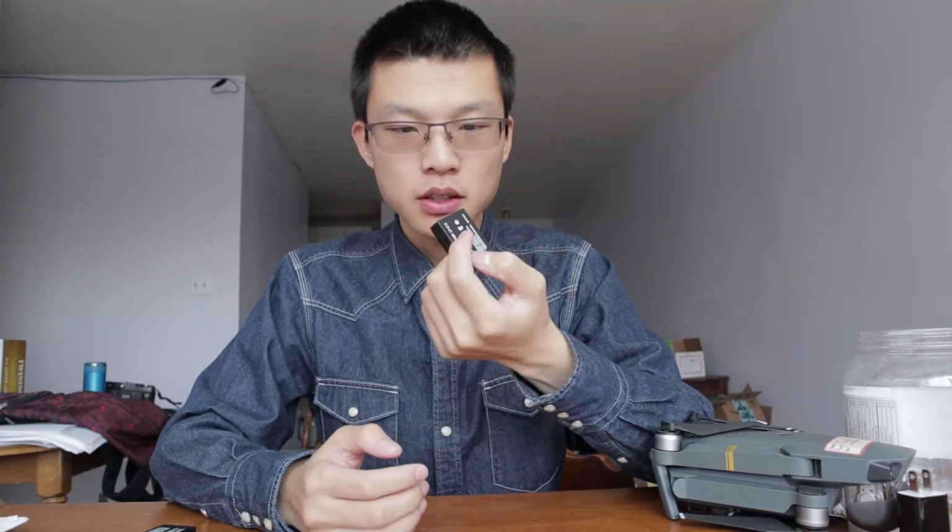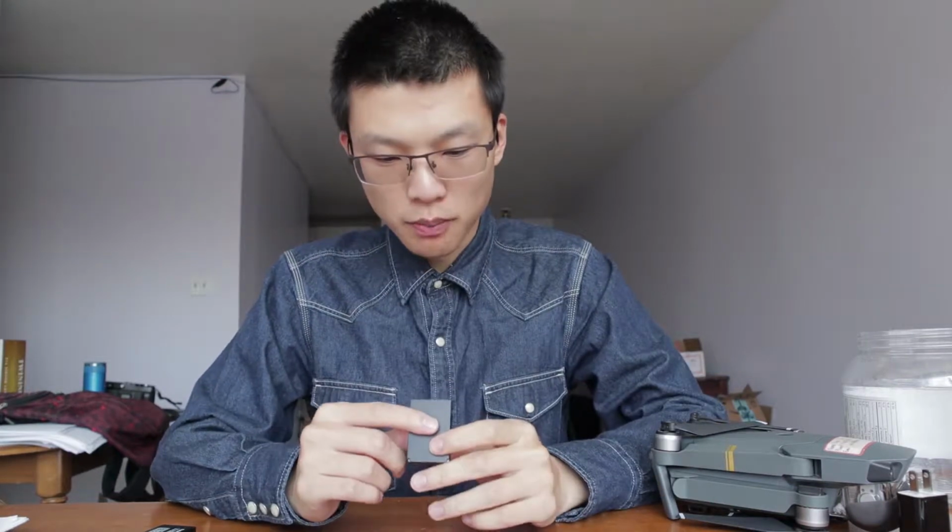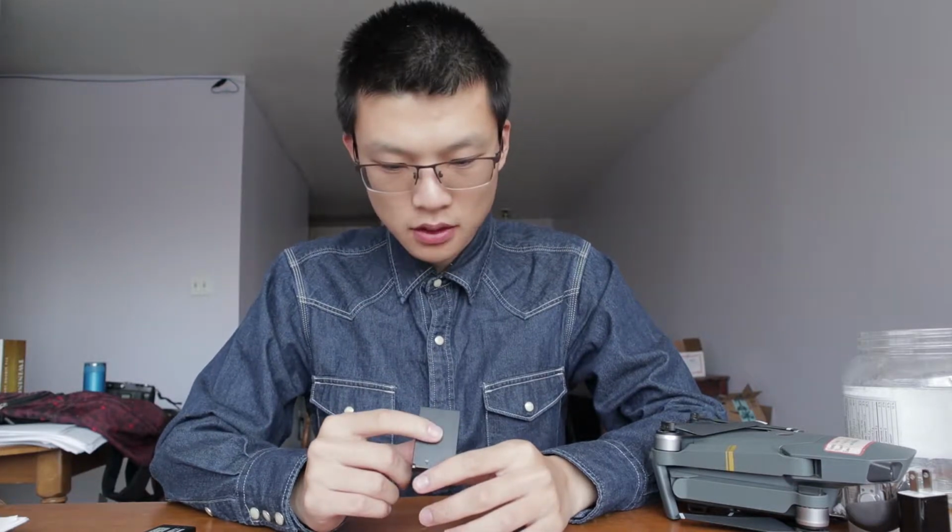I think two reasons might have killed this battery. The first one is that when I went out, this battery was not fully charged at all. It's probably around 60%. So when the cold wind blew, the temperature plummeted, causing a voltage drop, and the BMS, or battery management system, which manages all the critical status of the battery, eventually killed it, and it said it's going to sleep.